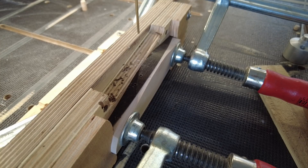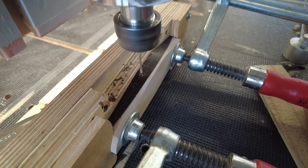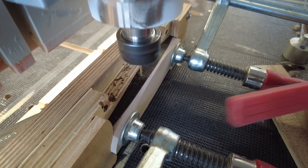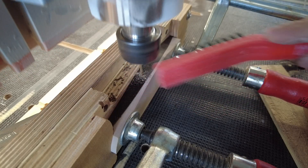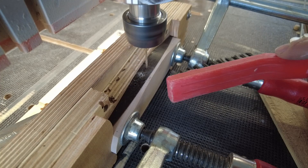For drilling the holes it's important to choose a program that retracts the drill bit, so it only goes about 2mm each time, then retracts. This lets you brush off the excess material so the drill bit doesn't get too hot and you get a nice clean cut.